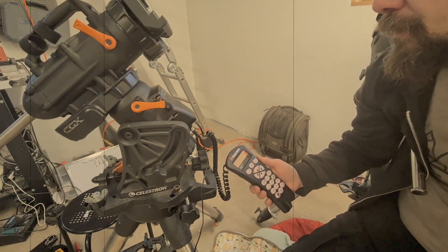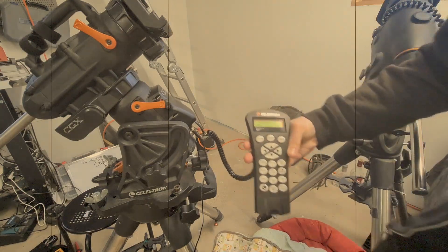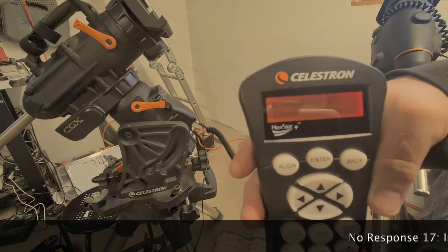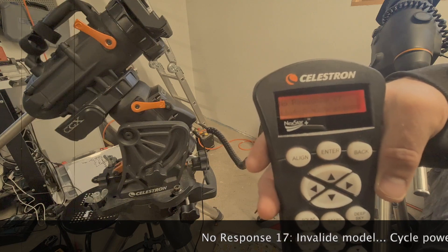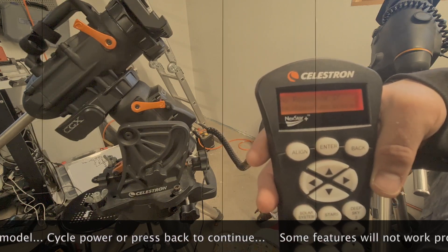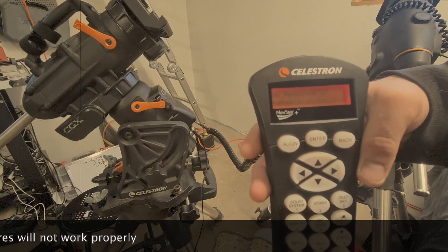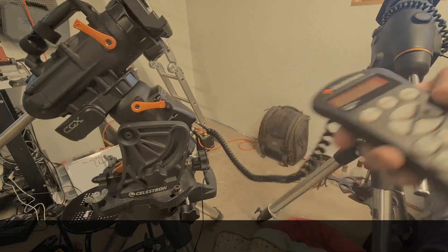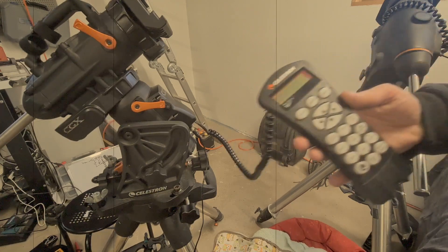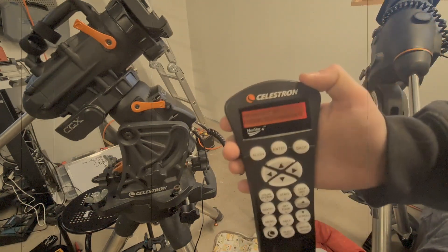Power's on. Verifying packages, please wait, initializing — and no response 17, just like before. So I've read up on Celestron's website about this. No response 17 refers to the right ascension motor and no response 16 refers to the declination motor. When you start up you get no response 17, and after alignment you get no response 16.